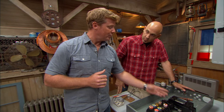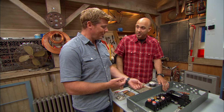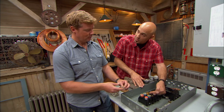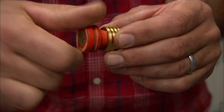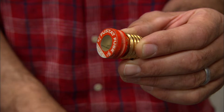Now that was always part of the problem, right? Because when one of these fuses blew, you had to get rid of this and put a new one in. And if you didn't have it, you couldn't use that circuit until you did. And if it was a 15, 20, or 30 amp, it didn't matter — they all fit in the same holder. They were interchangeable? That's right. So what happened later on, as electricians, you could only put the right size fuse in the right size fuse holder because of the thread differences. Oh, look at that — so they have an adapter that you would screw into the standard fuse holder, and this had different threads which only screwed in to that particular spot. So you could not put a 30 amp fuse in a 20 amp spot.